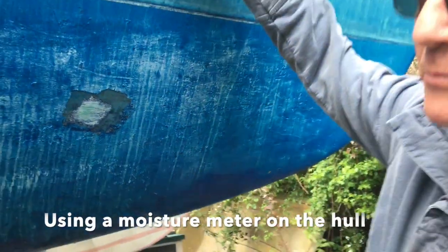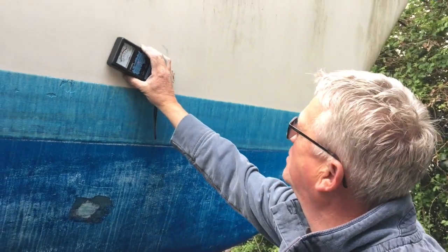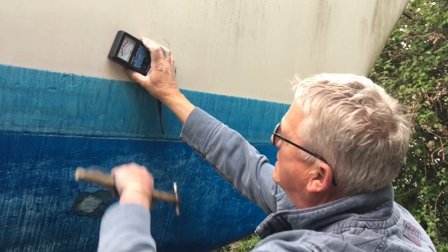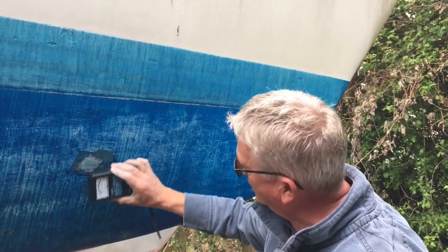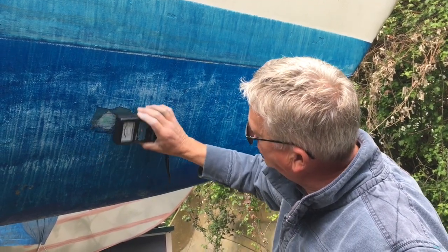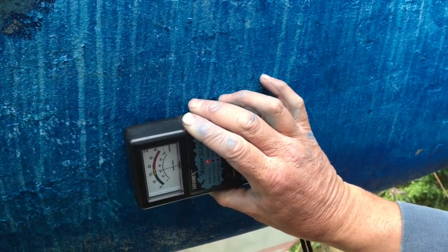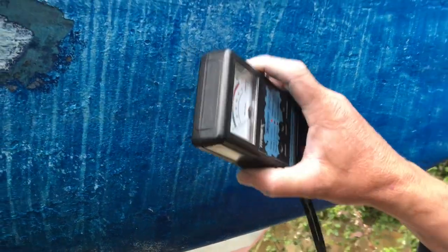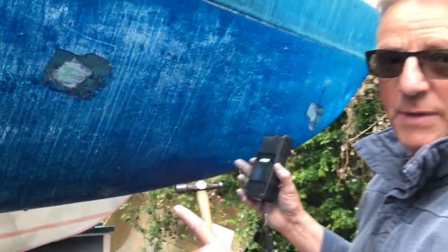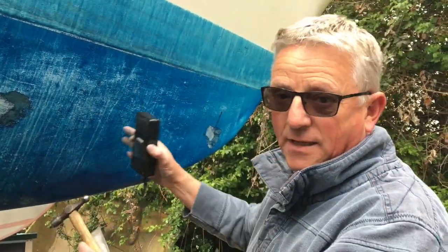All meters are not really moisture meters - they're comparative. Basically the topsides are running at less than 10, and down here they're running exactly the same. So that gives me an idea that there's very little moisture in the hull. Now in some of these areas near the anchor locker, we have got a little bit of moisture towards the bottom of the hull. When we go inside, we'll have a look and see what's causing that - it may be something simple like wet clothing, ropes, or even the chain lying in the bottom of the hull.